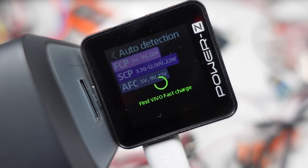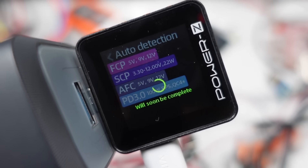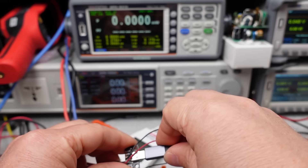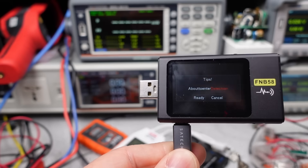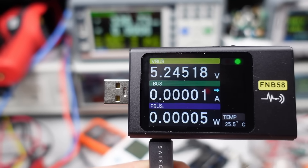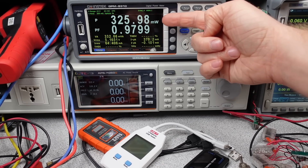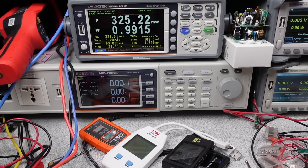Now that we know a little power is lost to the current shunt, something has to measure that voltage, and therefore power has to come from somewhere. These devices will use a little bit of power on the USB bus to measure themselves, essentially. This can be thought of as quiescent power — power that is always consumed no matter what the state of the circuit. A few of these are more advanced devices that offer a way to power the device externally to minimize this effect, and one of them is a pretty big offender, so it is probably best to be externally powered.